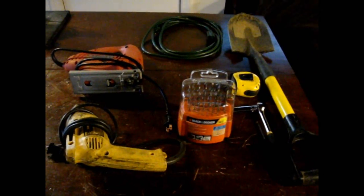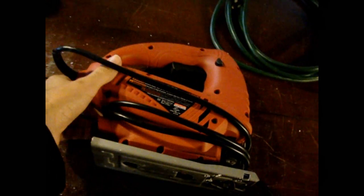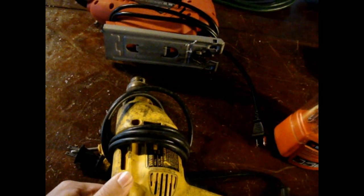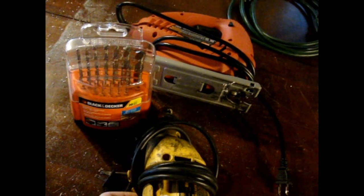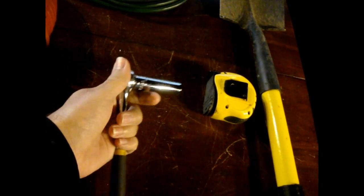This is just an overview of all the tools I used to do my solar ground mount install — there's not a whole lot of them. Just a little extension cord for the power tools. I didn't use this too much, just to cut one segment of the PVC tube. A drill to drill a hole in the end caps of the PVC, and some bits — just the one I needed to drill the hole for the bolts holding the L bracket to the solar panel. A socket set to tighten the bolts on the L brackets to the solar panel and to connect the L bracket to the PVC.